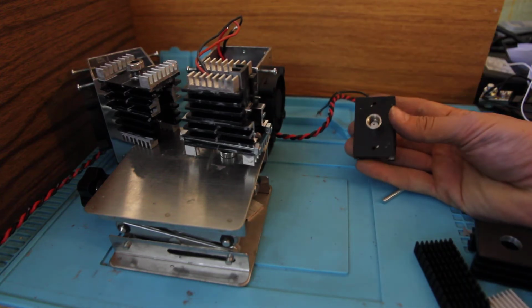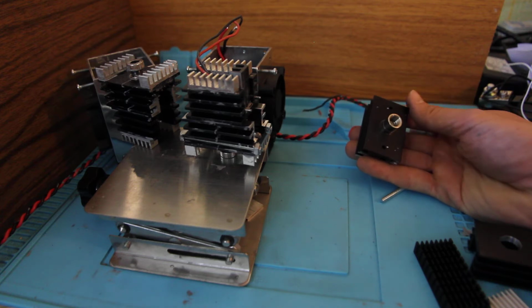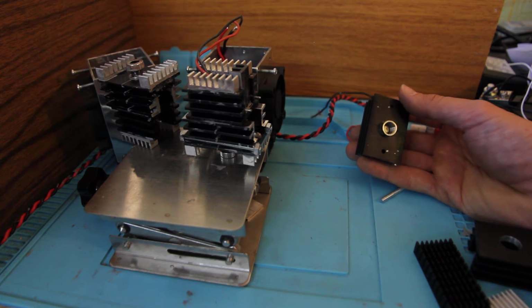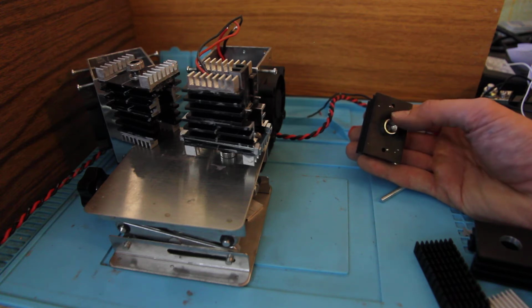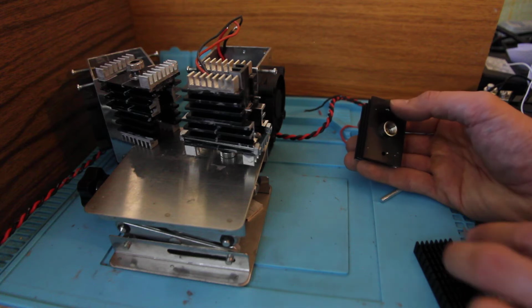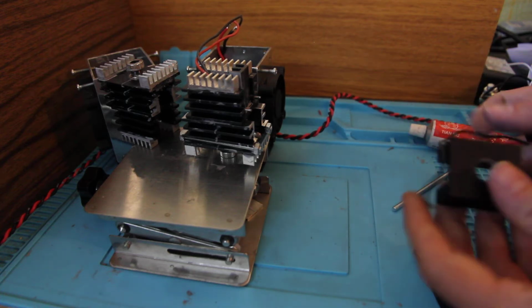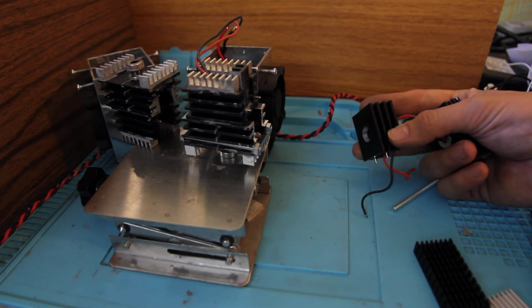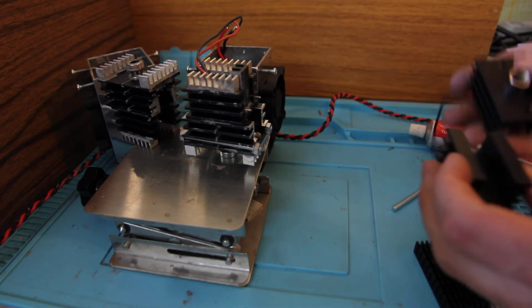So what we actually notice is that it's good, but it's not perfect, and we can improve it and make the laser more powerful, because the lower the temperature we have, the less power consumption we get, and the more powerful the unit is. So what we actually suggest is that you add another heatsink installed like this.